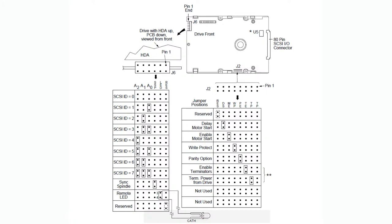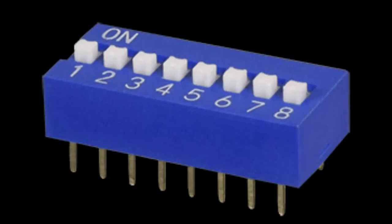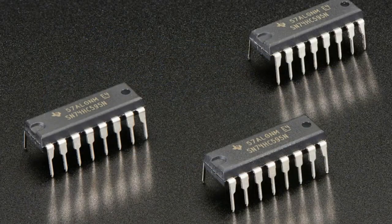So instead folks eventually started coming up with dip switches. Dip switches look like this and they usually have numbered switches, up to like 16 switches, and each one is a single pole single throw. These switches are all off - you can see the on direction is on the other side, and you can nick them with your fingertip and push each one on to close the switch, and then use that to configure your setup. The DIP in dip switch stands for dual inline, which is the same as a DIP chip. The nice thing about dip switches is they are 0.1 inch spacing, so for a perf board you can even use sockets if you want.